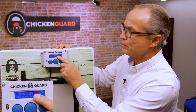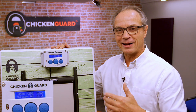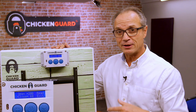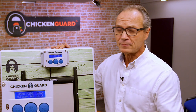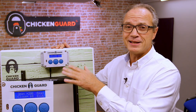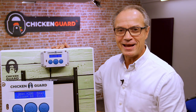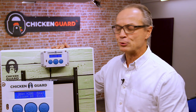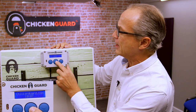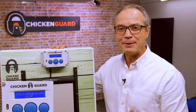To illustrate: the open is set at 200. If you wanted to open the door a little bit later you would increase that number from 200 to maybe 210 or 220. But this is not my preferred option for adjusting sensitivity, because what we're generally after is just delaying the physical door closing. So let me get out of this menu and head over to the sensor delay function and enable that.